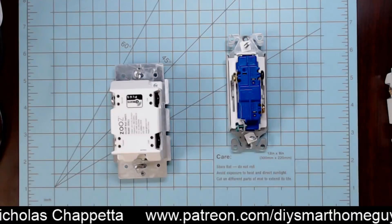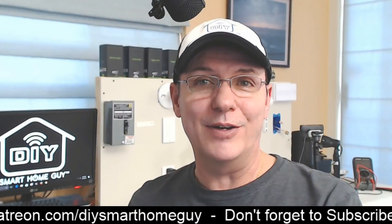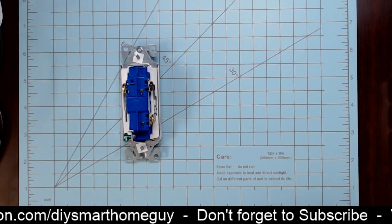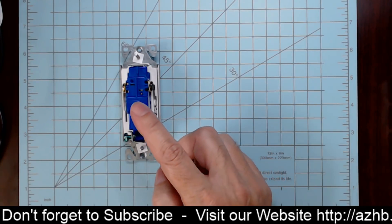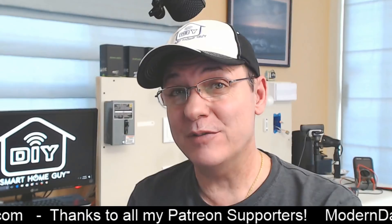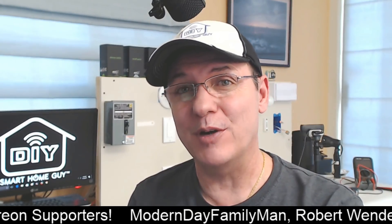In this video, we're going to install the Zoo's Z-Wave Plus in-wall smart switch in a three-way configuration, and we're going to use a regular three-way switch. That's right — no add-on switch. A three-way switch has three terminals: a black or common terminal, and two bronze terminals that connect to your traveler wires. And if you've got the bright idea to try this with a GE Z-Wave switch, stick around — I'll show you the results of my experiments where I wire the Zoo's like a GE and a GE like a Zoo's later in this video.